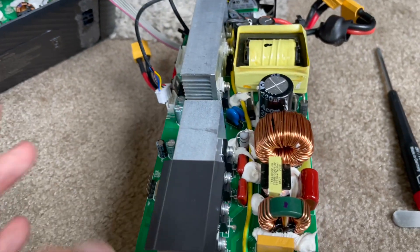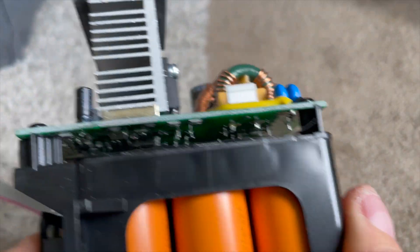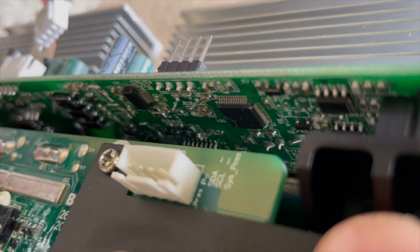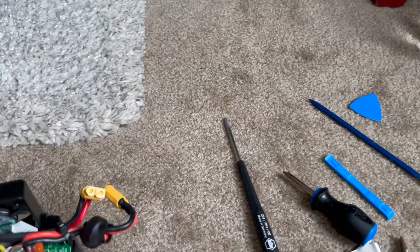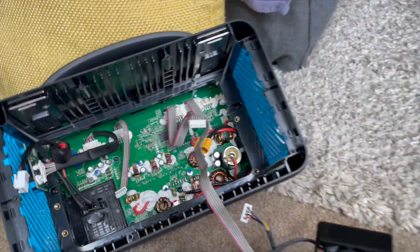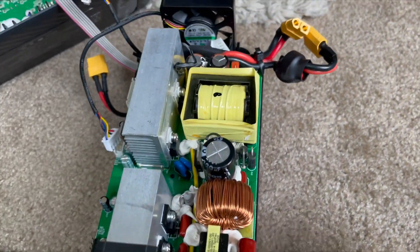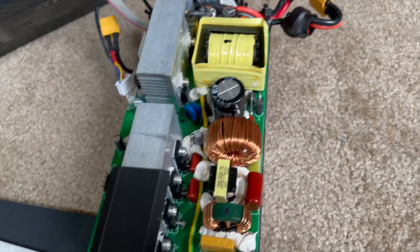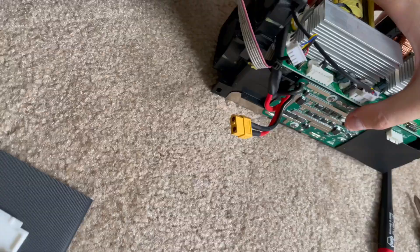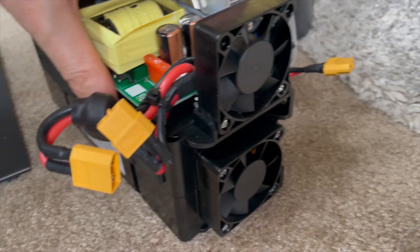You've got good heat sinking and a supported component tree on the board. I believe on the underside there is another controller — I can see a crystal, and yes, there are multiple controllers on this thing. That one is responsible for the inverter itself. It's nice that things are modularly done — you're not trying to get one microcontroller driving everything. You've got one driving all the DC stuff and the front end, and a separate inverter controller, possibly with its own discrete ASIC driving the pure sine wave inverter side.